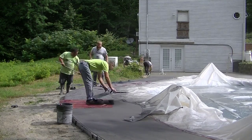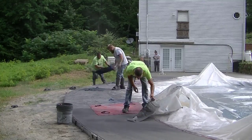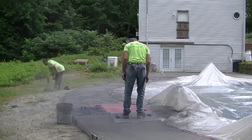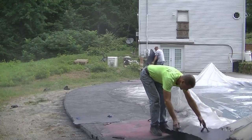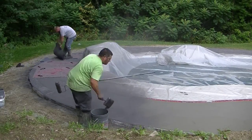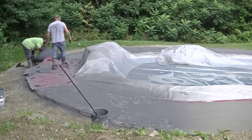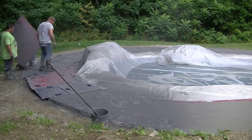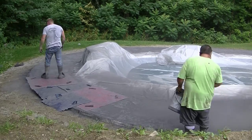We're throwing charcoal release powder today for our release dust, and that's going to add a really cool secondary color to the concrete — you'll see at the end when we get done and start cleaning. Right now we're just using a stone texture stamp to get a stone texture finish. This is what the homeowner wanted — just a stone texture look. We're going to saw some contraction joints in this the next day. We've got a roller with some stone texture on it we use for the edges, and that roller works really well to help stay ahead of the edges.